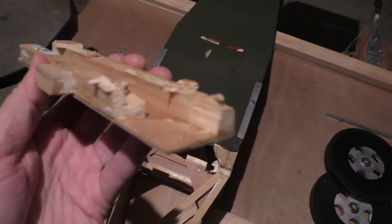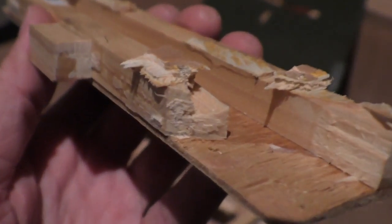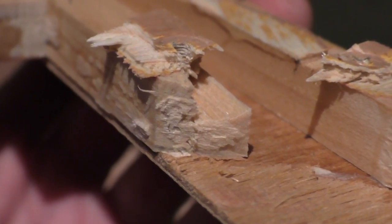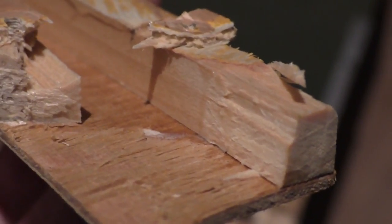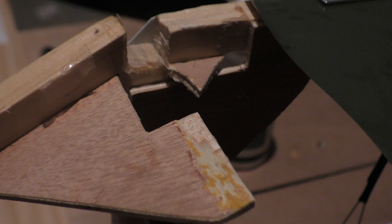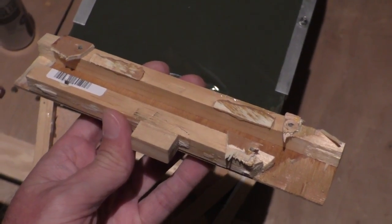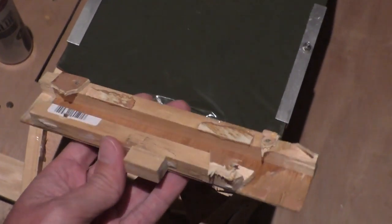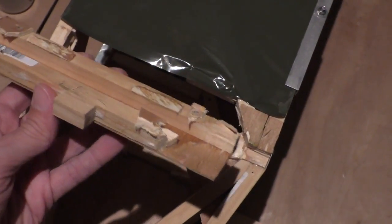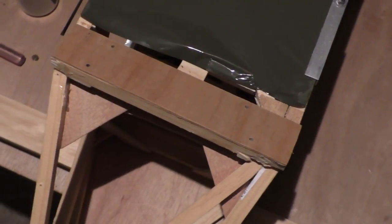But when you take a closer look at it, there's only a few spots where it wasn't the wood itself that broke. Like I think that one right about there, or even there's a bit of wood from the other side. So for the most part, and that, oh, is it that one? Well, anyway, but that is something to consider though, because I heard that PVA doesn't glue to itself very well, so you ideally want to be gluing wood to wood rather than wood to the old PVA. So anyway, I'm just going to stick it in and hope for the best.